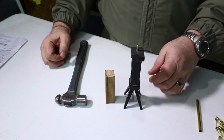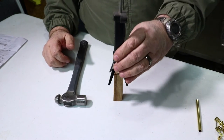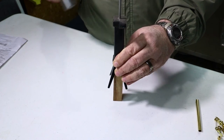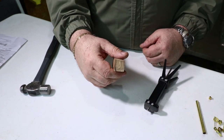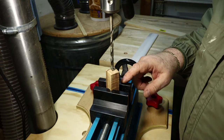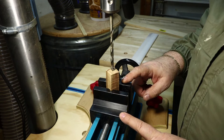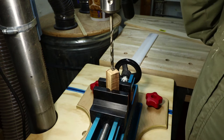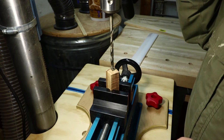What I'll do next is mark the center of my piece for drilling using my block square. I did a short video on this previously — I'll put a link in the description below. That gives me a center punch so I can guide my drill bit. I've got my piece mounted into my vertical drilling jig — I did a video on that one before too and I'll put a link in the description below. I'll drill through this, then insert the tube and square up the ends. Go slow and easy because you don't want to overheat your bit or the wood too much.